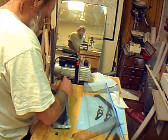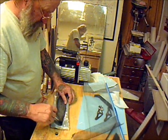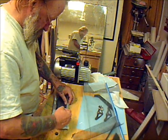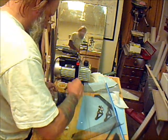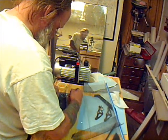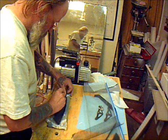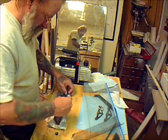This is a true composite wheel pant. I've seen a lot of wheel pants in hobby shops and they're normally just two layers of fiberglass — not very strong. These are really light because we're bagging all the resin out. When I say light, they're about seven grams a side, or half an ounce per wheel pant. That's not too bad — I could make them lighter but then they'd be flimsy.